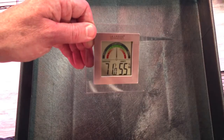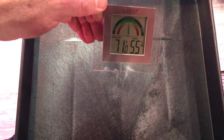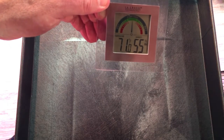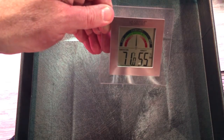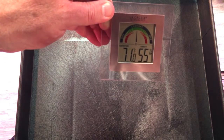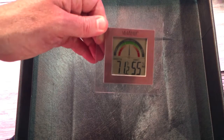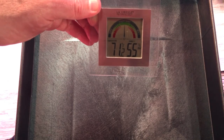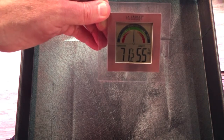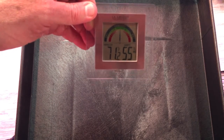I also use a humidity and temperature gauge in the basement. Generally in the wintertime the temperature will stay closer to 65 or 66 degrees. I'd like to keep it at 68 with 50% humidity if possible. Somewhere in the range of 64 to 72 degrees works well, and somewhere between 45% and 55% humidity is fine. That's what I'm generally working with.